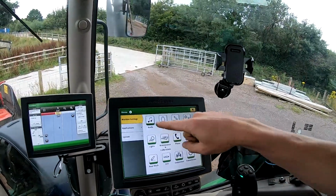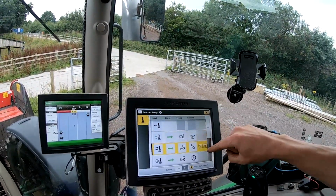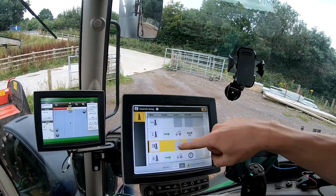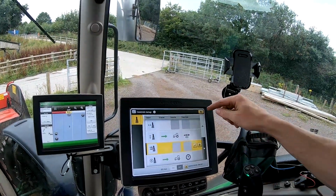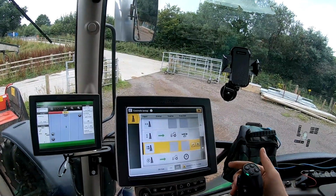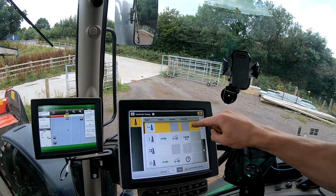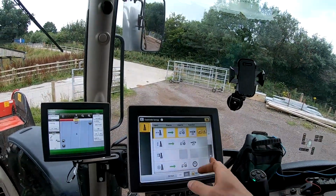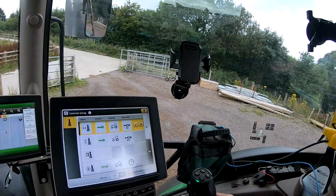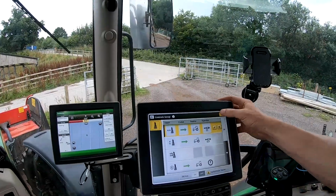Right, so once it's set at 88 there, you just go into control setup and you remove the function, so that won't do anything now, so it can't move. We've got that one set up on the front, which is good, that's what we want. And then this one we set up on the back one, which is spool 3. So hopefully that's correct. Yeah, that's all good. And that is that set up.